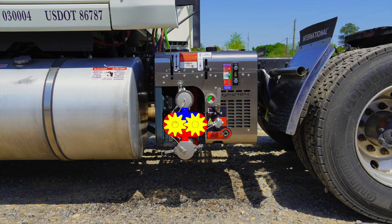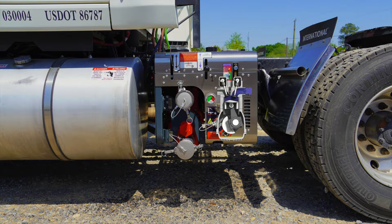We have improved the suction conditions of the product pump, simplified the access to the pump, and increased our ports from two and a half inch to three inch on the HC-180, while maintaining the tried and tested P40 compressor on the right-hand side.